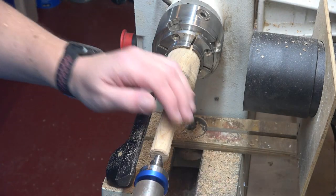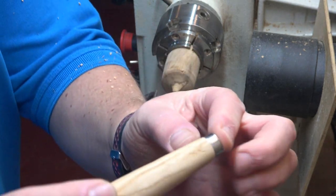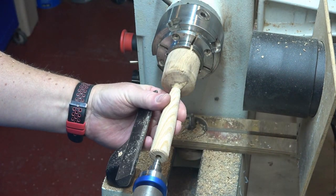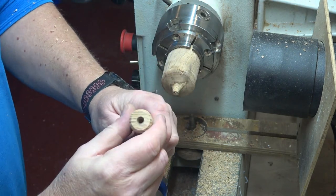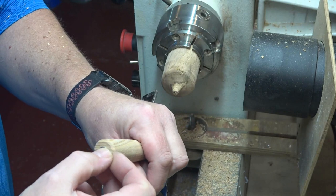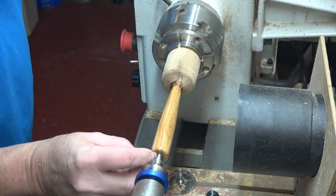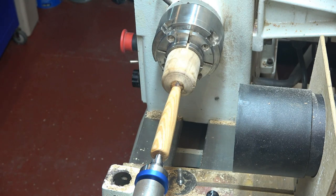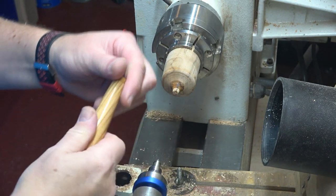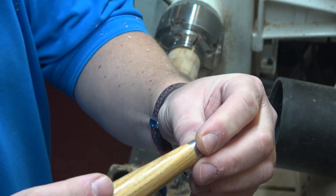Because we're turning between centers I can take my handle off and just double check the fit — and that's not looking too bad. We'll pop it back on and then really just look at finishing. There's all kinds of things you could do up the end cap end as well if you wanted — you could measure the outside of the little end cap and countersink it, whatever you like really. Once you've got your finish as you like it, you can remove the handle and we're looking ready to fit the kit together.